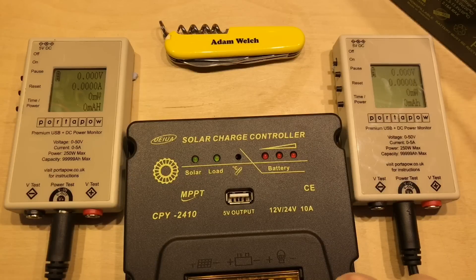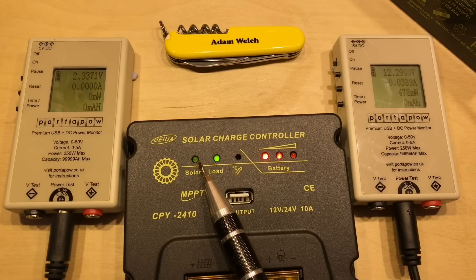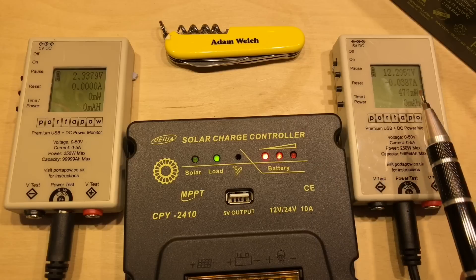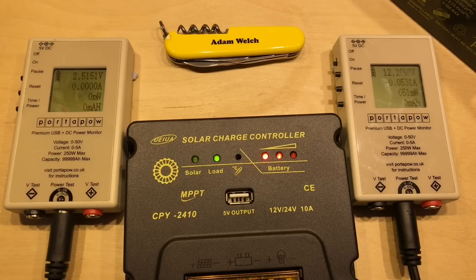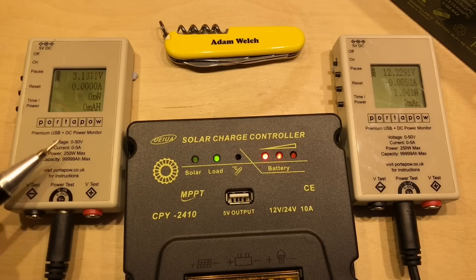With the battery plugged in showing 12.3 volts - I've discharged it pretty well. The load light is on; how you turn off the load I have no idea - I guess that must be voltage-dependent because there are no buttons on here and no solar connected. The battery indicator is showing half charge, two out of three. Strangely, this unit is drawing nearly 50 milliamps - five times what the manual claims - and it's still going up. Also oddly, we're seeing 3.3 volts on the solar side as if some voltage is leaking across.